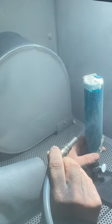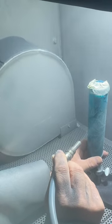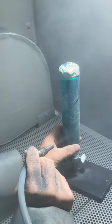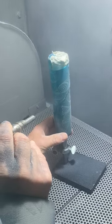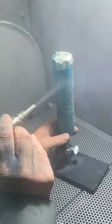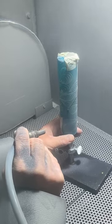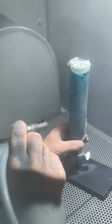You can use really fine media or coarse media. If you're doing deep carving you use a thicker photoresist; if it's finer detail you use a thinner resist. This is our R3 material, so it is designed for thin glass with very high detail and high complex images. Here I'm just running my nozzle across to make sure I hit every spot. This design does have a lot of open islands, so I want to make sure everything's covered properly and I didn't miss any detail areas. In this application the glass is about an eighth of an inch thick, so I can't go too deep, but I do want to get enough so there's a good feel on the carving. I do small circles kind of like an orbital sander, creating depth a little bit faster, and you also get a smoother background when you do small little circles.